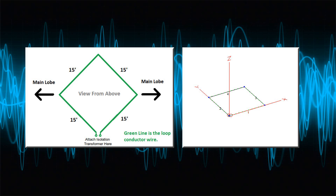I did mine a little bigger because I don't necessarily care about 20 meters — I was mainly interested in 40 through 160. I also found that I really like using this antenna as a shortwave receiver; it displays really good characteristics for pulling the noise floor down. It's a highly attenuated antenna, but because it's directive and becomes omni-directional as the angle of the received signal increases, it does a really good job of scrubbing noise out of the signal on a noisy night.